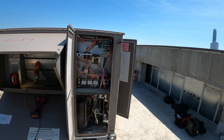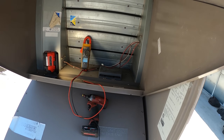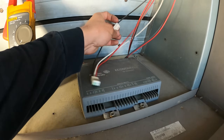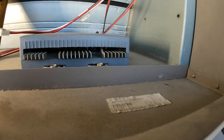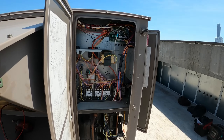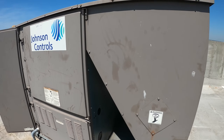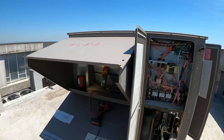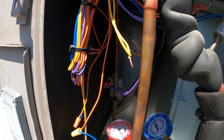I disconnected the SA bus — common, negative, positive — and there's definitely something wrong with that. I unplugged it and there's green corrosion. Look at this — rusted up. That cable is done. It's going to have to be replaced. The economizer might be good, but if you've got a bad communication cable or bad economizer you could set off all those alarms. The 24-volt common wasn't reading so something is bad — something's rusted. This building is only five years old so this unit has been up here about five years. This thing is done.